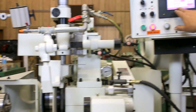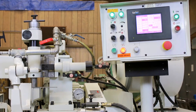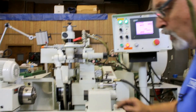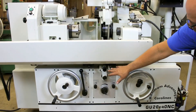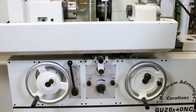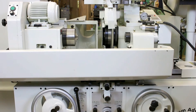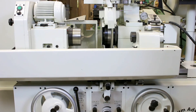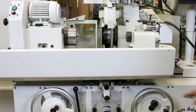It also has a traverse grinding program where we have the table going longitudinally left and right. I have some information already in here. The table is hydraulic and there are dogs that have to be set on below, like a normal hydraulic grinder. We start our cycle and at each reversal we'll feed a little bit, or we can set it to feed only on one side, the other side, or both sides.